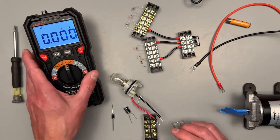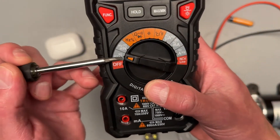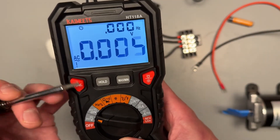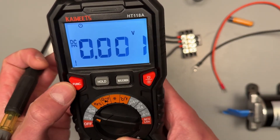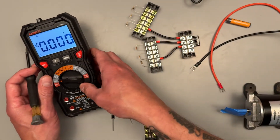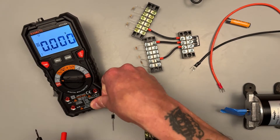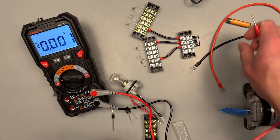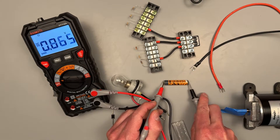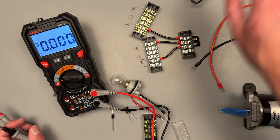Let's keep the screen backlit for the rest of the video. The first setting — what does it mean? Here we have hertz as one of the functions we can select, and we can see AC and hertz up there as we cycle through the two different functions. It is an auto-ranging meter, which is a very nice function. This setting is your run-of-the-mill DC voltage measurement, like a battery — red to plus and black to minus — and we got just over 1.5 volts.